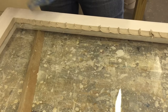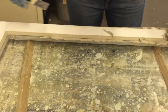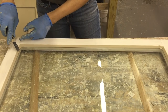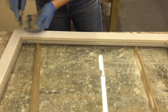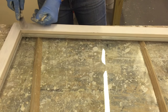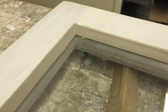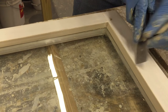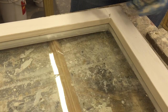Keep cleaning those corners — they always have to be perfect. You slide the knife across the surface, and that puts your putty at a nice 45-degree bevel. It doesn't have to be exactly 45, but you need that bevel so that water can sheet off, along with debris and anything like that. It also looks really nice with a clean angle. In the corners, you want to see a nice clean mitered corner — it's putty, but you can make it look like wood if you do a good enough job. Once the corners are finished, we move on to cleaning the glass.